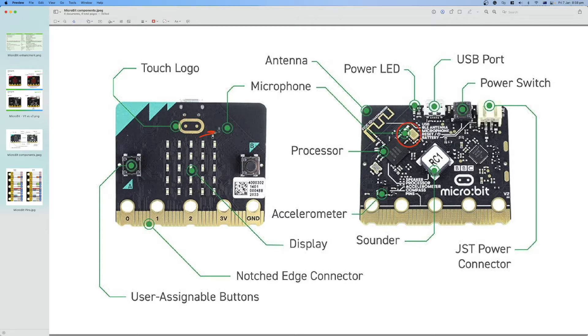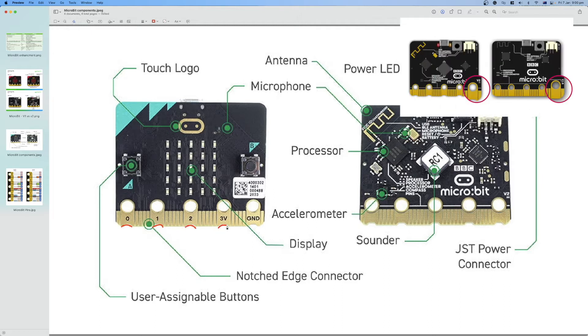There is a microphone chip connected to the front hole, so when sound enters it is processed by the chip and sent to the processor. Micro:Bit also has an antenna for sending radio signals to other Micro:Bit boards or computers, and can communicate using Bluetooth Low Energy — version 5 in Micro:Bit V2. Additionally, the LED matrix can be used to sense light, and there is a temperature sensor. The notched edges on the board are new to version 2 and were not present in version 1.